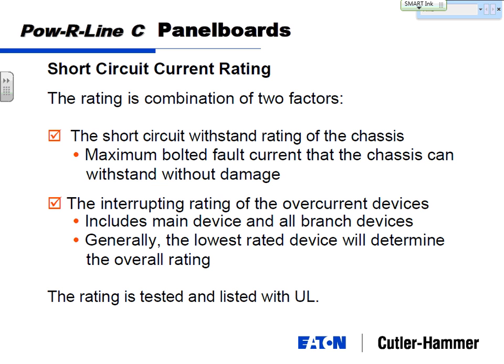So in this trip unit here is the smarts or the intelligence that's telling when things should be taken offline and at what value they should be taken offline. There are two types of trip units. Number one is a solid state device. Not very cost effective in any of these smaller type breakers, but once you get up to 400 amp and larger, more often than not you'll have some type of solid state device. What that does is you basically have CTs, current transformers, built inside the circuit breaker that always look at the current that's flowing through and make a decision: should it trip or should it not trip. So that's really looking at the signal. It's looking at the actual current, deciding what to do depending on the value that it's reading.